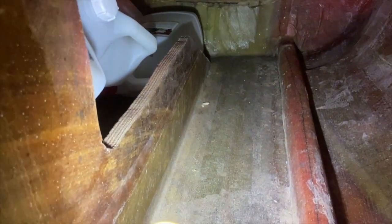And if that were to be compromised, or under this bulkhead here, if the rudder, when the boards aren't more than about half down, hits something, the rudder could pitch up. As it gets forced back, it could pitch up and punch a hole through the bottom here. So I'm not entirely sure that it's a great idea to have a hole in a watertight bulkhead.